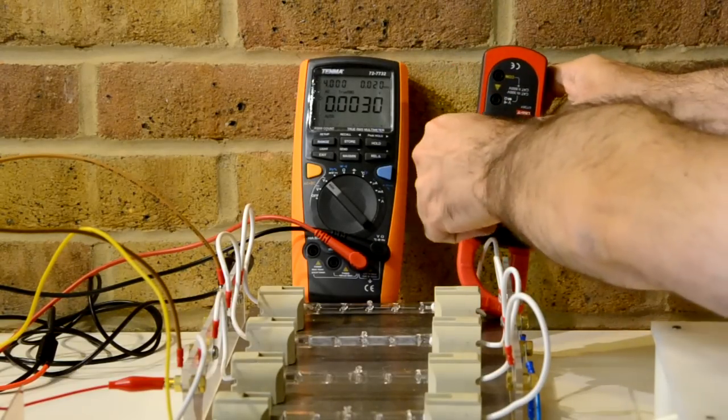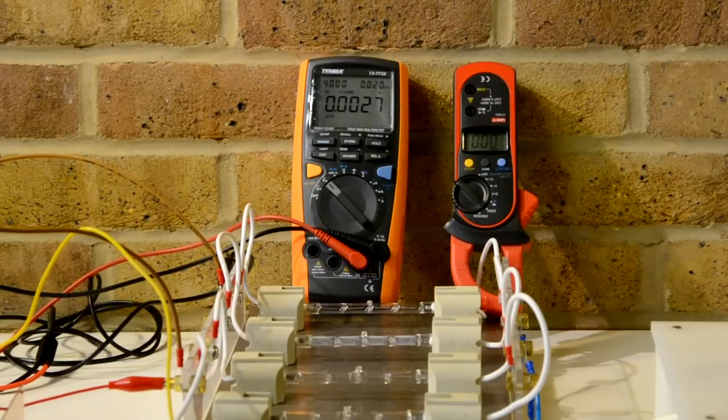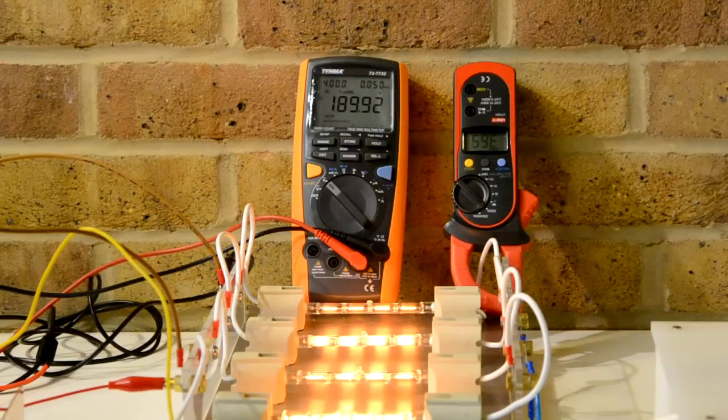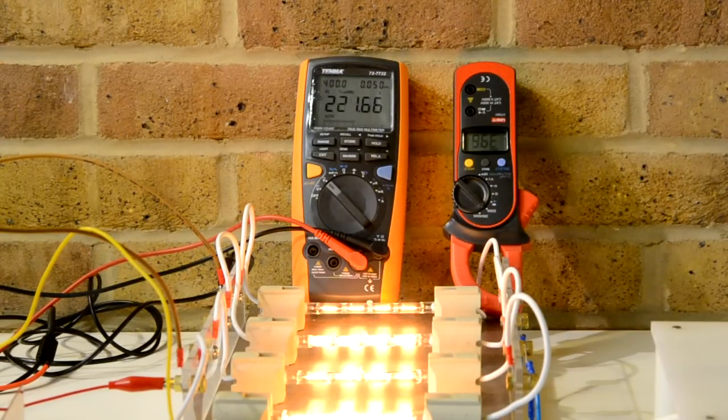Let me start this one here for you. Let me start it up to main voltage. So here you see around 20 volts — you see 50 volts, it starts to glow slowly. 80 volts. I will go to 240 volts, so that gives you some indication of what 200 volts in a series resistance gives you here. 220 volt — let's leave it like that. That's 0.4 amp, 230 volt. So that's the current draw of the series network, and that's the brightness we have to deal with.